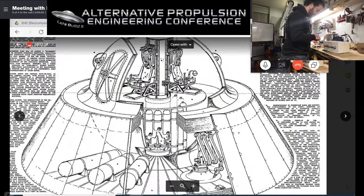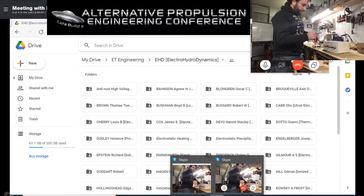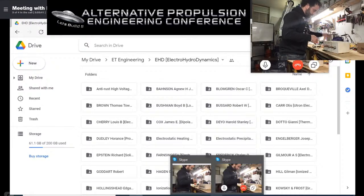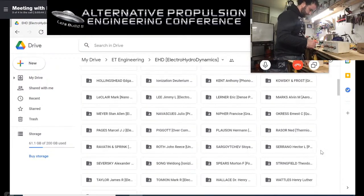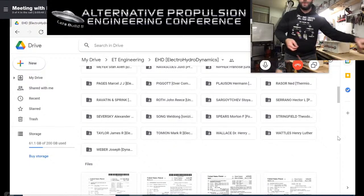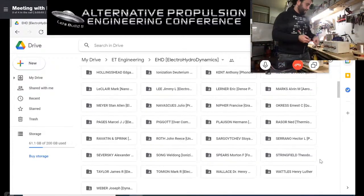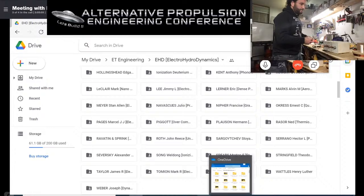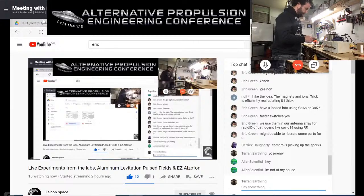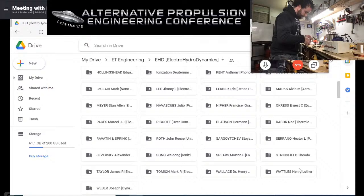Okay, just to be clear, we ran into some technical difficulties over here with the experiment because of the way the coil was round. It was arcing over on itself, and we're going to have to redo this coil winding, so we're using this other smaller coil right over here. We're going to try the same setup with it. It also has some steel screws in the circuit, so that will provide a little bit more inductance to the circuit.